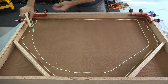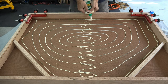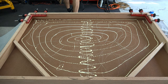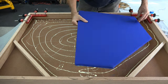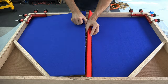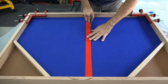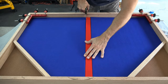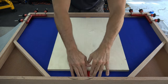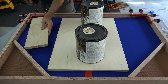With your display boards complete, you can mount them to your backplate. Lay down a healthy coat of wood glue and set your pieces in place. Double check that your backplate is firmly up in the backplate rabbet before you do this. I place a little extra glue down where the blood stripe will be, and then I lay my pieces down into position. I take a paint scraper and I slide it across the joints to make sure no felt is bunching up. And then I weigh down my pieces until they dry.